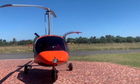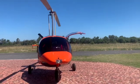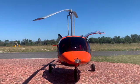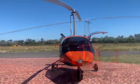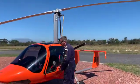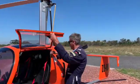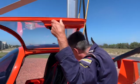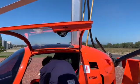Gyroplanes are inherently very safe because of their high wing loading and their stability. They're a normal three-axis aeroplane apart from the fact that you have to build and stow the wing once done flying. So why do accidents happen? Controlled flight into terrain or wires, rotor mismanagement on the ground or airspeed mismanagement in the air.